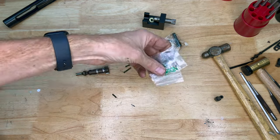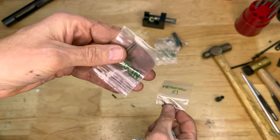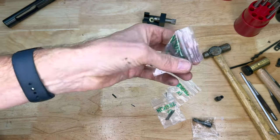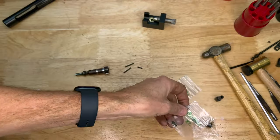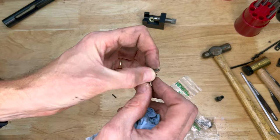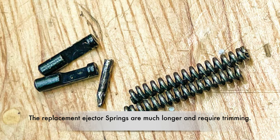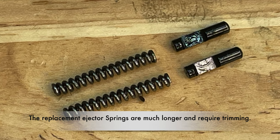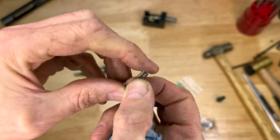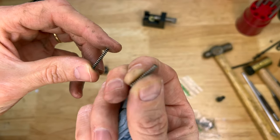After about two or so weeks they sent me an envelope. It came with a new roll pin for the ejectors, two new ejector springs, the updated gas regulator, and two new ejectors themselves. Now the ejectors themselves were not an issue — however what was an issue was the springs. If you look at these springs, they're kind of kinked up, a little deformed. I'll roll in some still pictures so you can see those, and actually one of these feels physically shorter than the other one.